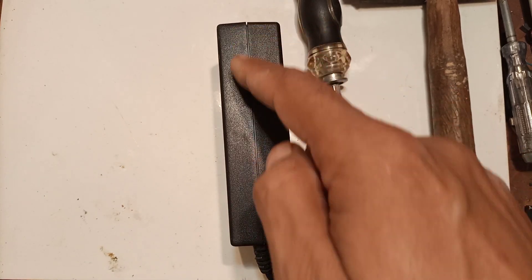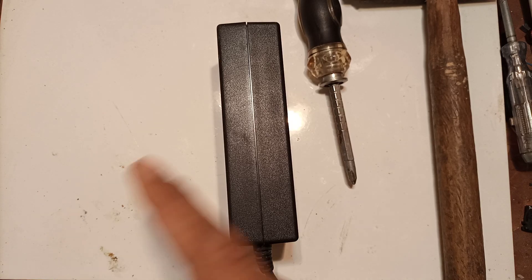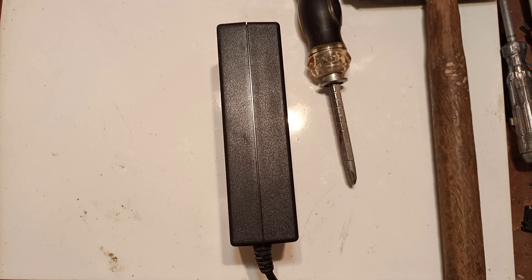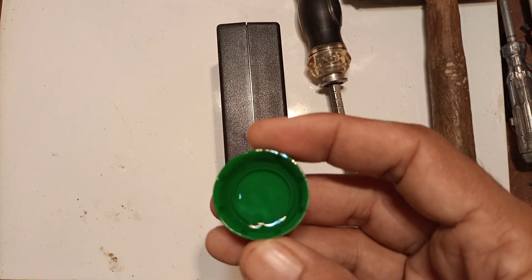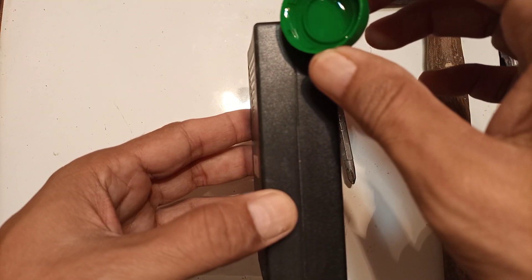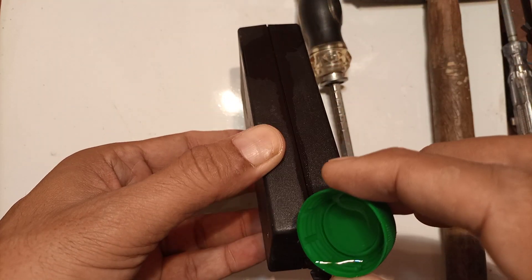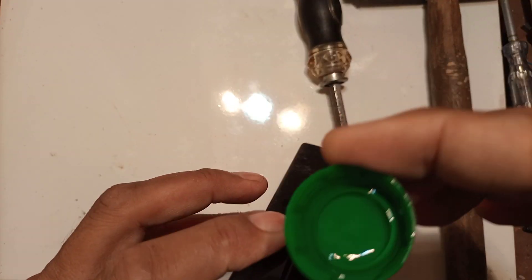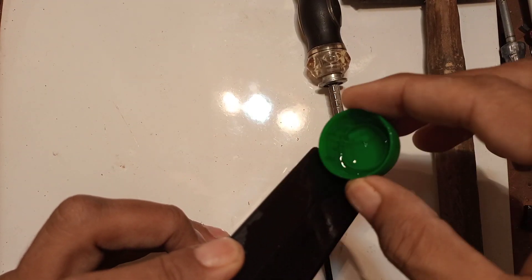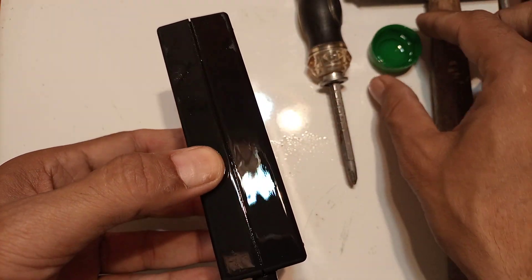The way is, we will crack it over here from this joint. But if we crack it open from this joint directly, this will become broken. So the easiest way is you have to have some solvent like thinner or regular gasoline. As in my hand, this is gasoline. Just take a little quantity only — this is in the lid of this bottle — and pour it on this device at this joint, all the sides. Not too much, but a little quantity.